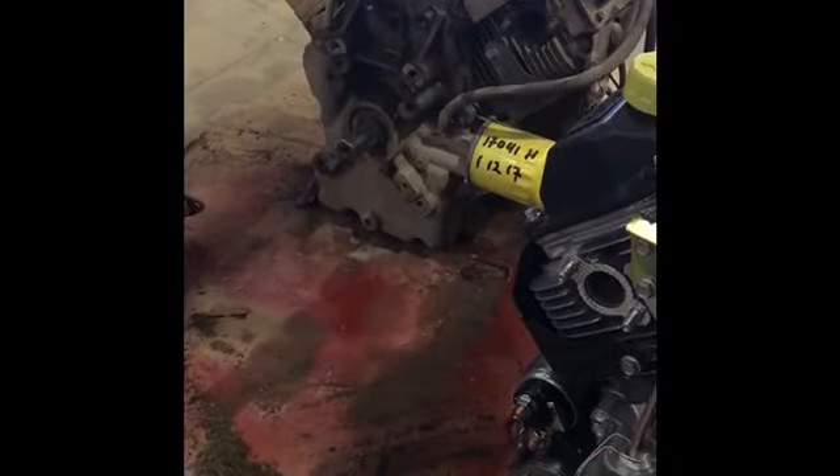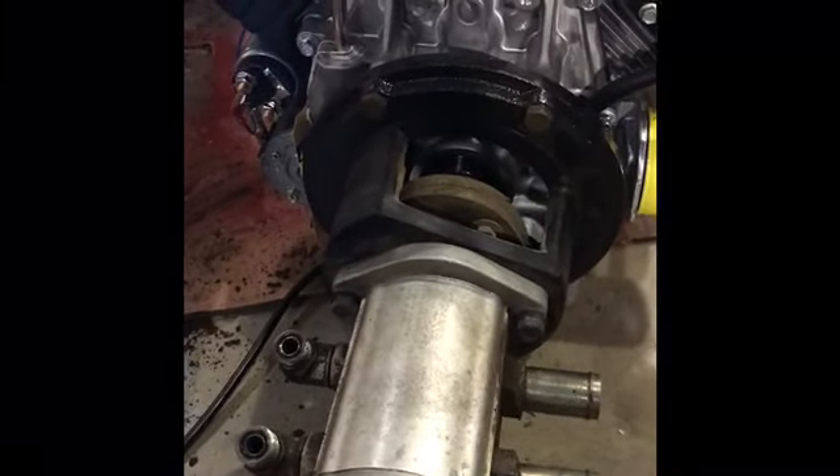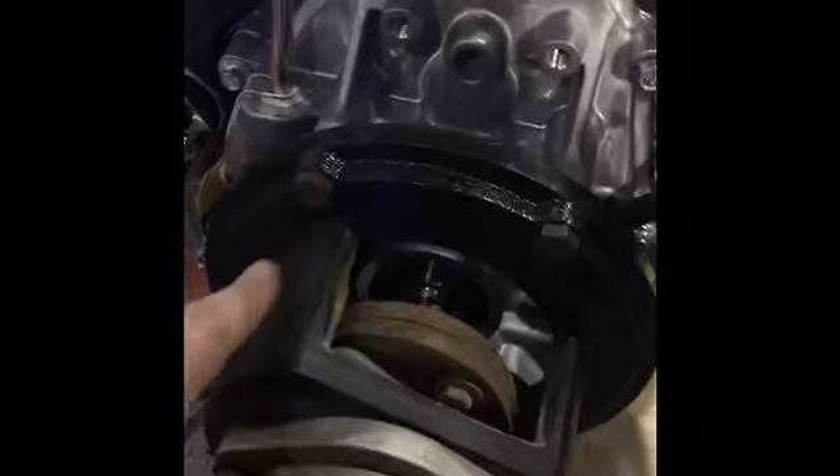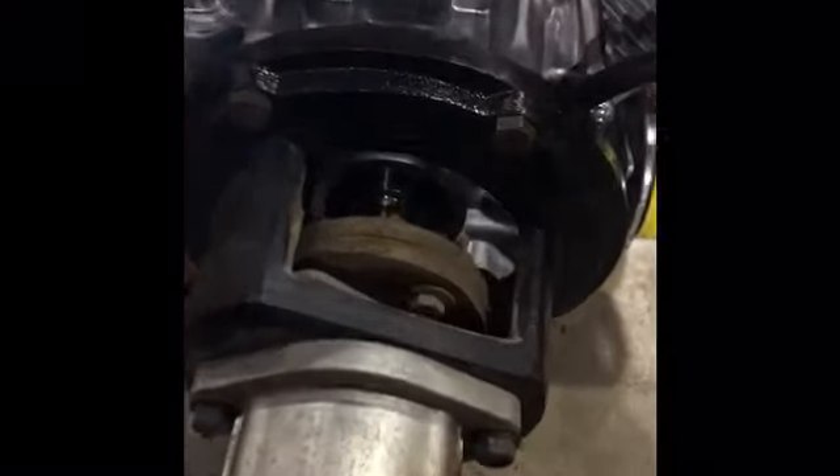Next, remove the pump and the housing off the old engine — I've already taken it off and installed it on the new engine. There are four bolts: two on top and two below on the same hub. Remove those, then come in to where the coupler meets the crankshaft and you'll see four square bolts in there. Find the two square bolts closest to the engine and loosen those.